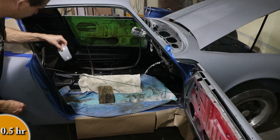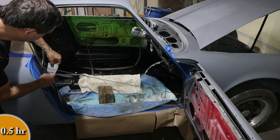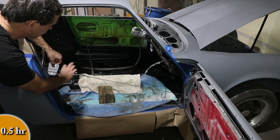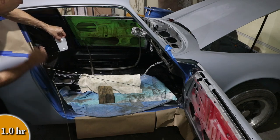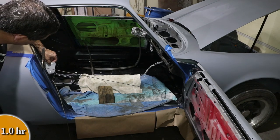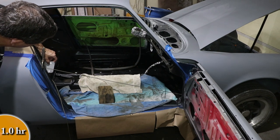Here's yet another template. This one is designed to attach to the roll bar, and then it will have a connection to this round tube here. Two bolts will secure it. The roll bar is more vertical than this pillar, so this is about perpendicular to the bar, and we'll go to the roll bar right about there.